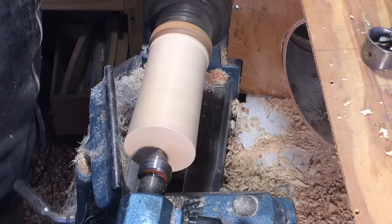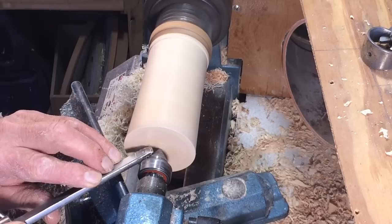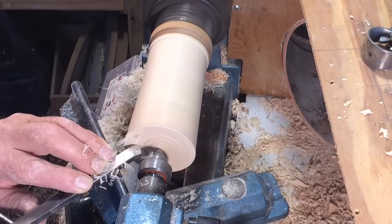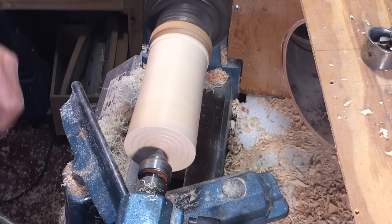Any people who really will worry about there being a mark at centre, the other turners, but if I want to disguise that a little bit, I can make three little grooves in there using the point of the skew. Oh, might as well go across the lot. And so suddenly the bit in the middle begins to look like a bullseye. So now I can carry on sanding.